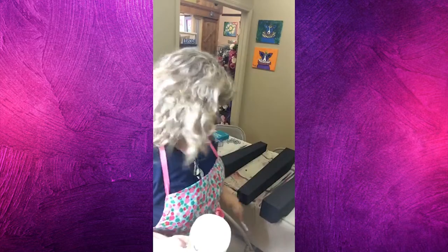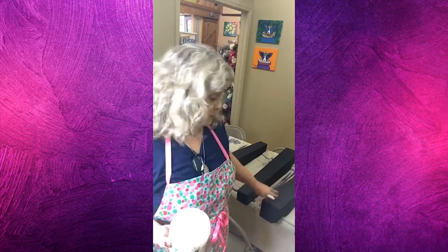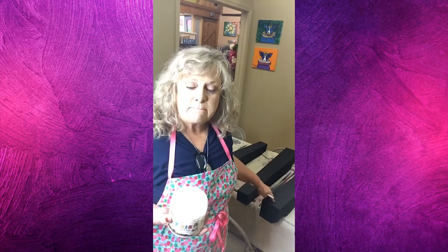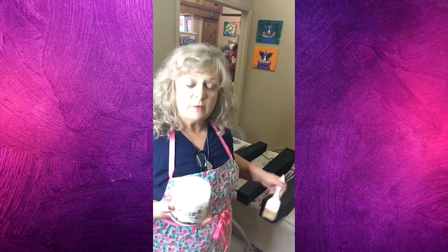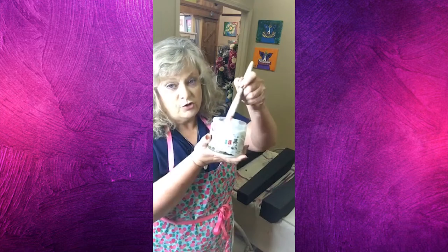get it on here. And I'm going to go ahead and put it under the bottom too, and on the top edge, because this is a clay based paint and it has no kind of sealer on it. And I do want that to be sealed, because if water was to ever get on it at any time, it could reactivate that paint and lift it off. Now the paint will cure after 30 days and be harder, but the top coat's going to protect it during that time and thereafter.